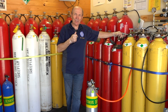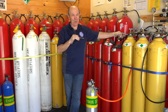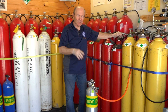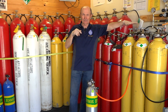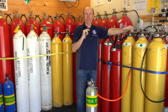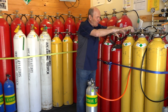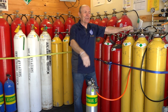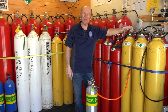Using a cascade system to fill a scuba tank doesn't seem logical. But it works. Your tank is empty - it's a 3,000 PSI tank. Let's assume I have one bottle filled with my compressor to 3,000 PSI. Yours is empty, this has got 3,000. If I open both valves and try to transfer the 3,000 into your tank, it won't work. The minute I open the valve, the pressure starts to drop - down to about 2,500 - and then they're even.